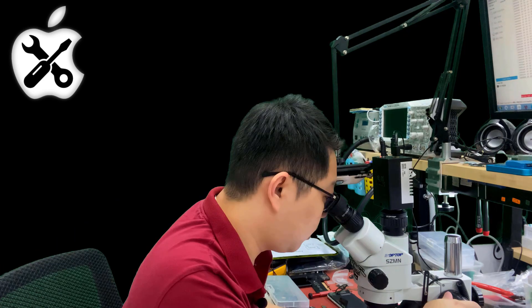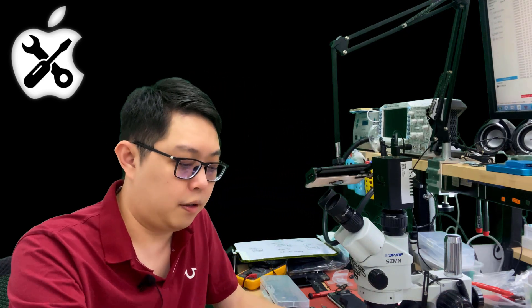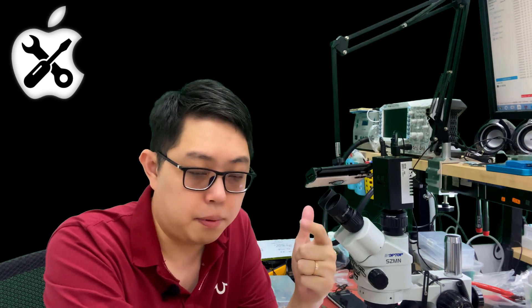Until this point you will understand — there are some things that cannot be repaired because Apple does not allow us to. Just remember: in order to recover the data, you must look at those three things — CPU, Logic EEPROM, and the NAND. These three things must all be original. For iPhone XR and above, if this little EEPROM is damaged, we cannot do anything for now.